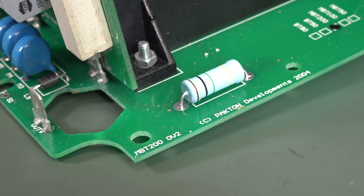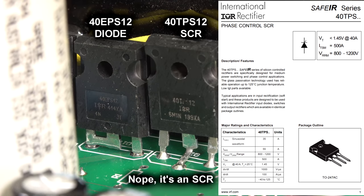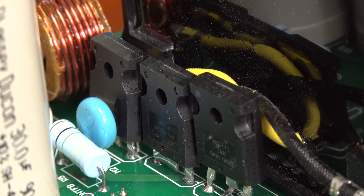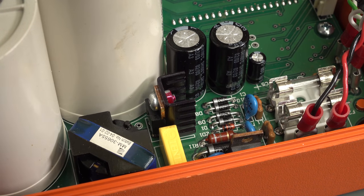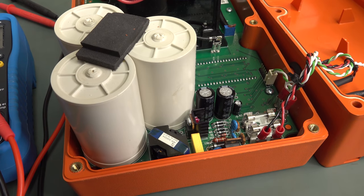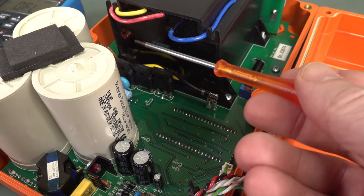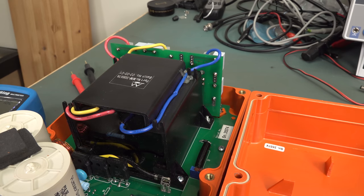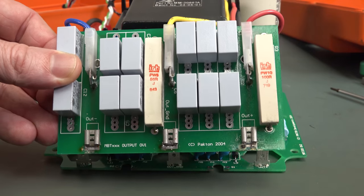You'd get a proportional current in the phototransistor on the other side of that optocoupler. A few power transistor aficionados there — but the one on the left, the friend of Jake the Peg, has only got two legs. Both of those other parts are diodes, not transistors. So obviously we've got a first-stage switcher here. Here's our switching transformer. That would be generating around 700–800 volts into these 900-volt caps which are all in parallel. You wouldn't push it right to 900. Then you'd use this other switching transformer here to take the energy from those caps and drive your main transformer to boost it to your high output voltage.